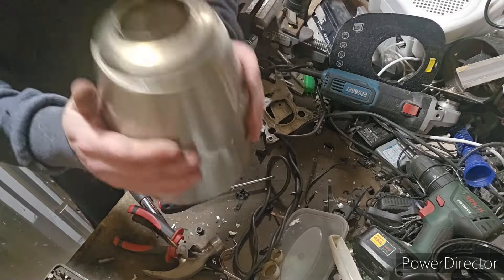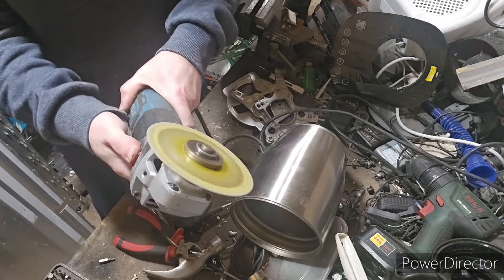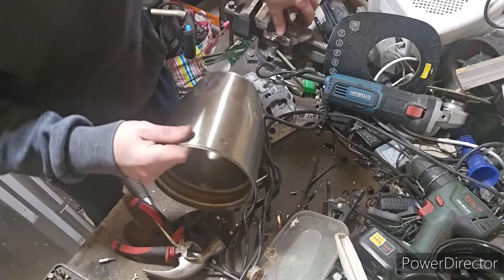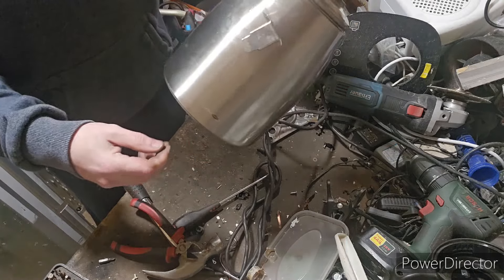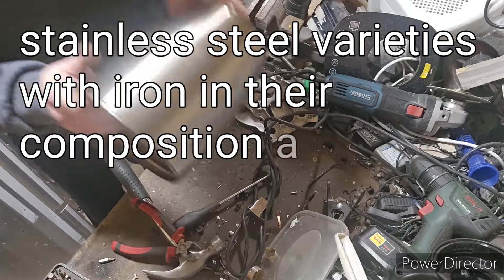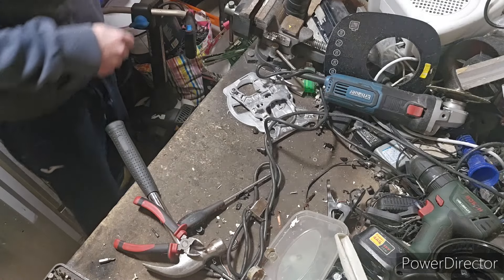The one check I have to do now is to check if it's stainless steel. To do that we hit it with a grinder or the cutting disc. These are nice big sparks off of that. I did think the magnet wasn't sticking to it, but this is stainless steel - even though the magnet is sticking to it very loosely, it is still stainless steel. Because the magnet sticks to it we're going to have to put that into shred. That's a bit disappointing, but it is what it is - and what it is, is shred.